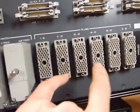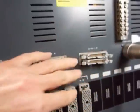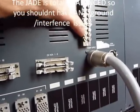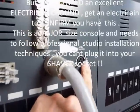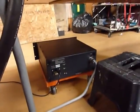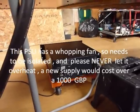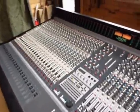There are 96 tie line holes, plenty of space for gates, compressors, and effects. The automation track mix hardware is present but not sold with the desk anymore. There's a nice big bus bar for star earthing if you have a lot of external gear. The power supply is around 300–400 watts. The legs weigh about 30 kilos each, and the whole console weighs around 250 kilos — a good four-man lift on the flat, with plenty of fun going through doorways.